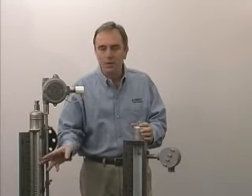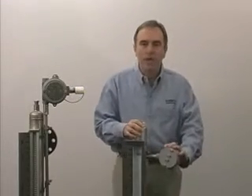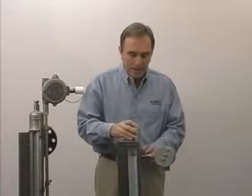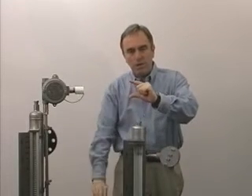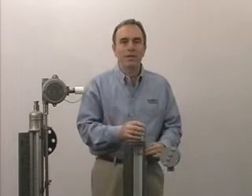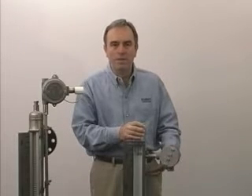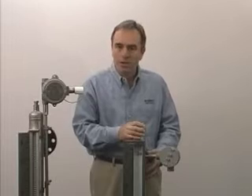So far, all we've talked about is visual indication for the fluid level in the tank. Now let's talk about some control options. On this PVC gauge, I have a level switch mounted. The level switch mounts with just a hose clamp on the side of the chamber. Inside this assembly is a latching reed switch, and when the float goes by, it closes the switch; when the float goes the other way, the switch opens. So you can have a high-level alarm on your magnetic level gauge. This does not penetrate the gauge — it just straps onto the outside, so if the operator says the switch is actuating at the wrong point, you don't have to shut the vessel down, cut a hole, re-penetrate the vessel, and weld something on. You just loosen the clamp and scoot it up or down to wherever the proper actuation point should be. You can also add switches at a later date without shutting the process down.